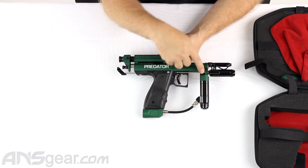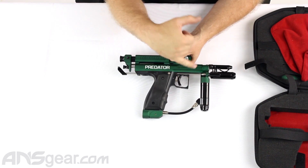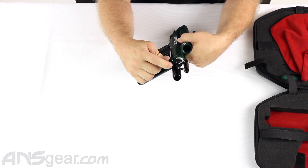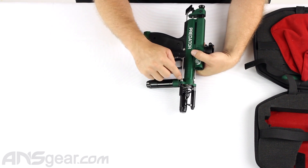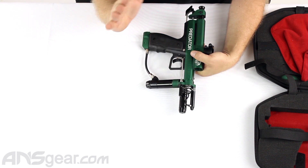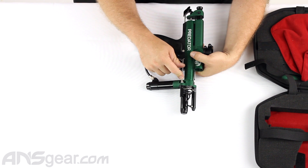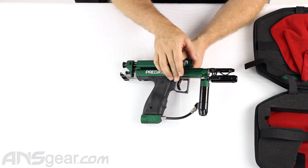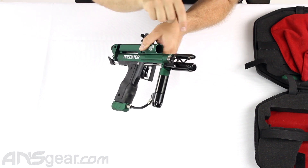On the other side we have our three-way, our three-way collar, and our actuator rod — all adjustable. The nice thing about changing the timing on this three-way is you're not grabbing the collar and rotating it. The end of the three-way shaft has an Allen key slot in it, so you just stick your Allen key in the end and turn it. That screws the whole assembly into or onto the actuator rod and changes its starting position, changing the timing of the gun. Typically you'll see it flush — the shaft flush with the three-way body.